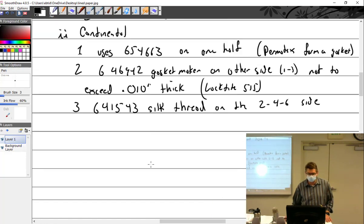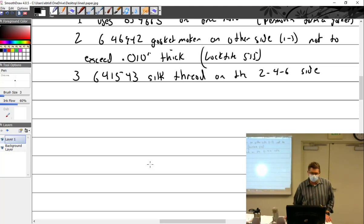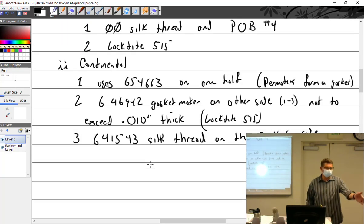All right, so there we go. That's how to seal them. If a little bit of sealant is good, then a lot is worse. What happens if you put too much sealant in there? Then it's going to hold the cases apart. Then what happens? Whatever the right clearance is, then the sealant wears out, and then the case starts fretting, and then everything goes to hell in a handbasket. And so, yeah, use the appropriate amount. And by the way, this Permatex stuff, oh man, it just gets on your fingers and it doesn't come off.